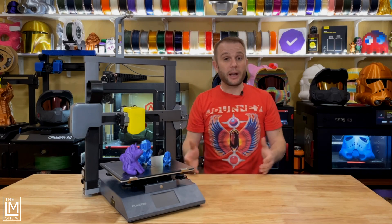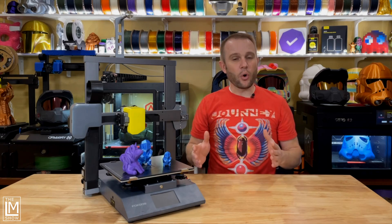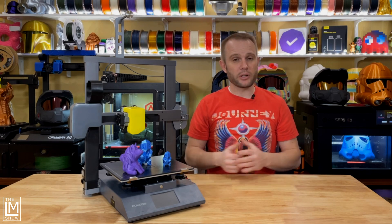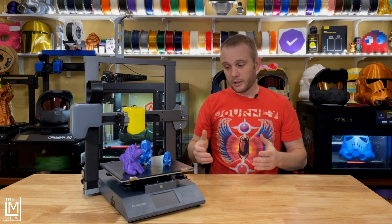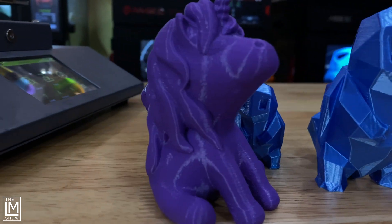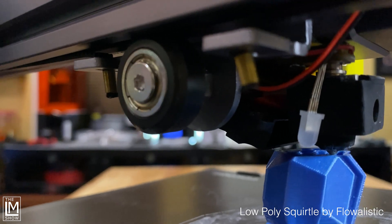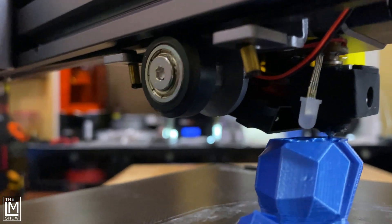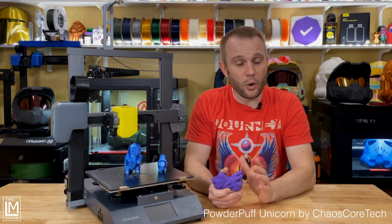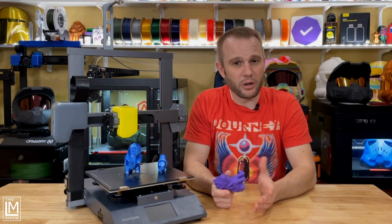In conclusion, you might ask me what I think about the new Odin Smart. Having only had it for a couple of days, I don't have a whole lot of opinion, but I will say that I do believe that this is going to be a fantastic upgrade to the Odin 5 F3. Print quality is what you'd expect, very similar to that of the Odin 5, very clean. Cooling, I will say, is quite impressive — it seems to have cooling capacity quite a bit greater than the Odin 5, and I'm guessing that's because the Odin Smart is marketed as being able to print six times faster at up to 300 millimeters per second.